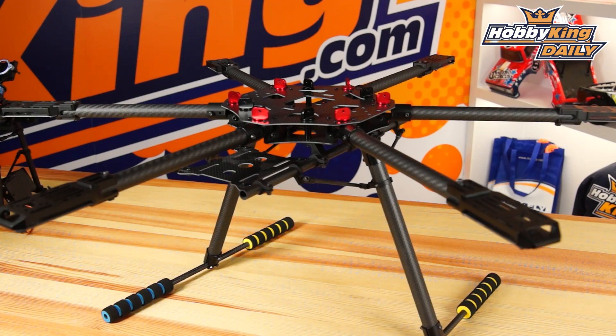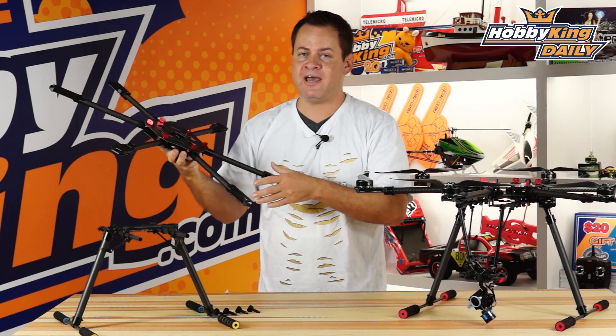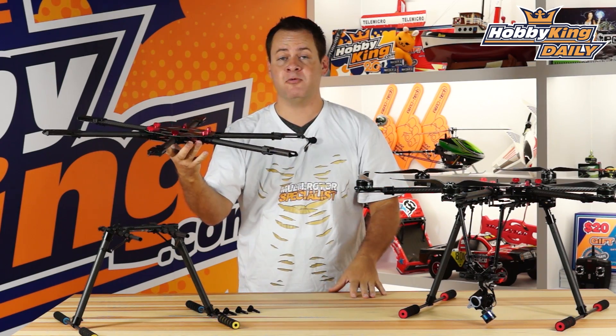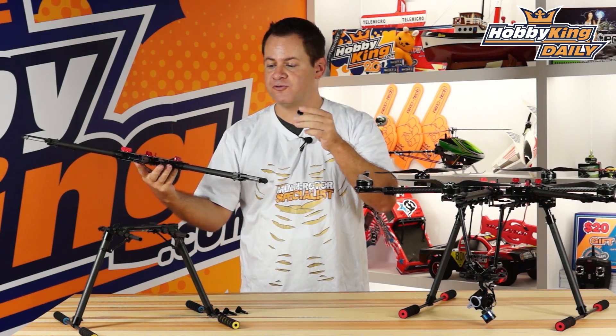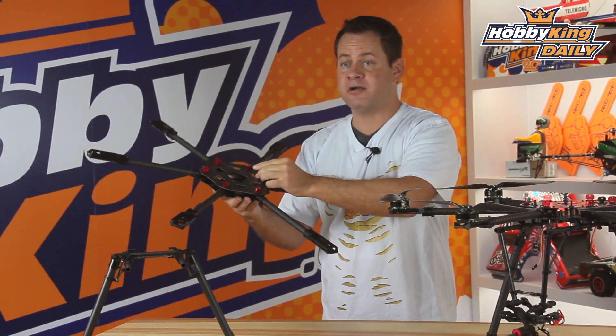This was designed as two sub-assemblies. The hexacopter itself — I'm just going to remove it from its undercarriage — is designed so that it houses the flight controller, the motors, the ESCs, everything related to its ability to fly independently. It has really nice lag-style thumb screw bolts that bolt through the frame, and these are all hard anodized aluminum — very light.